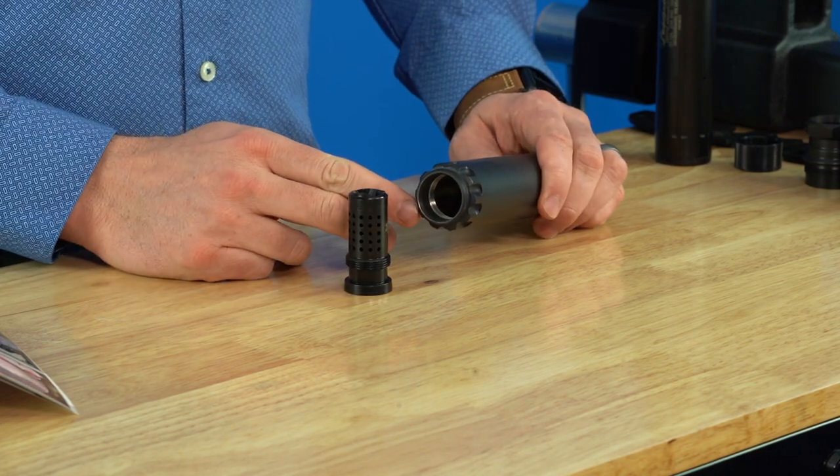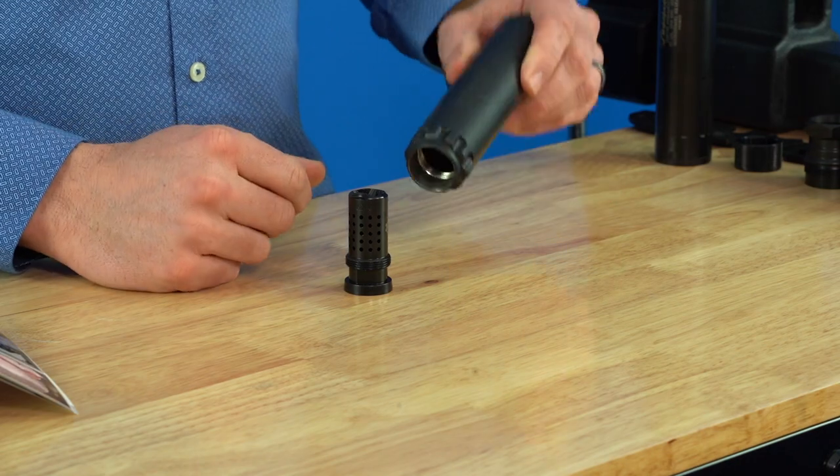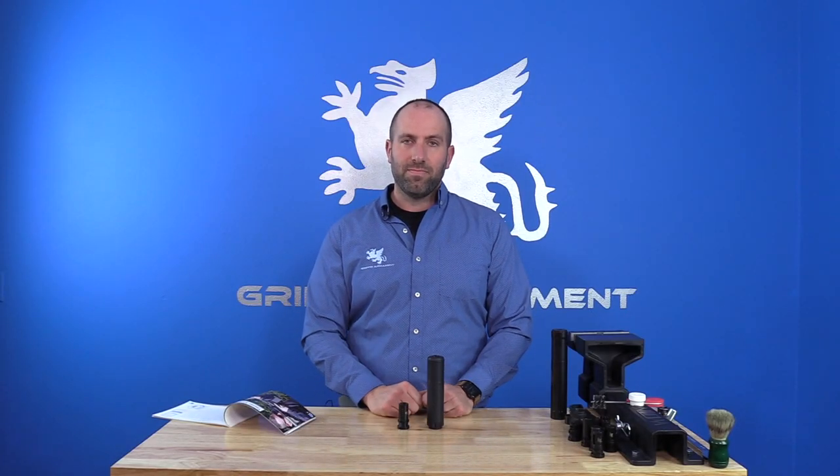The thread offers attachment to the silencer and the taper offers precision alignment to the suppressor. The suppressor is fitted with the taper and a thread interface as well, so the two can be used in unison. That covers the features of the taper mount system, and next we'll get to talking about the accessories and installation.